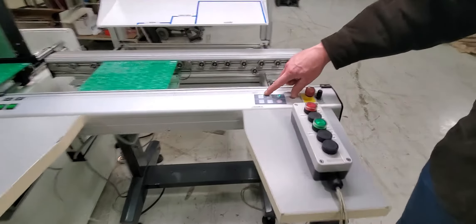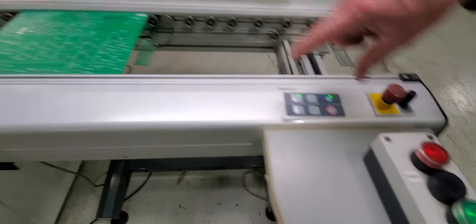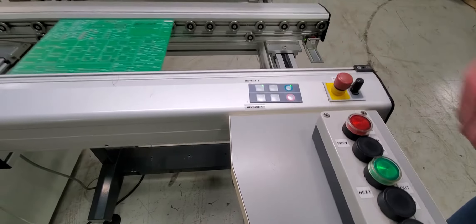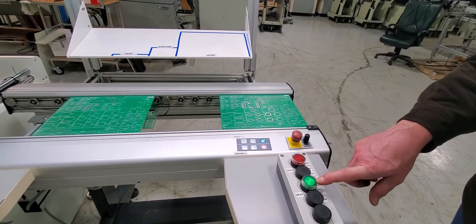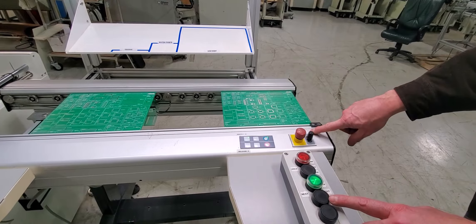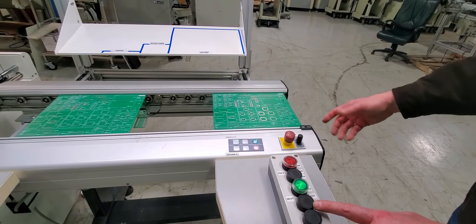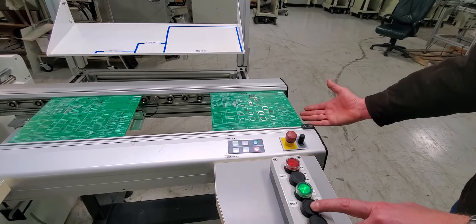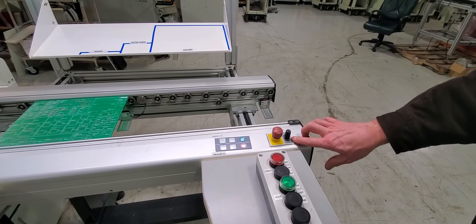The conveyor is in inspect mode right now — that's why this green light is on, and that's why the board is stopped in the center. After it's inspected, you can push release. It goes down to the end position, providing a signal to the next conveyor. We'll simulate the conveyor to call it out. This unit has the exit slow function, so you can vary the speed of the exit section when it's unloading to match, say, an oven. You'll see how it's coming out at a slower speed than what it came in at, and that's adjustable with this pot.